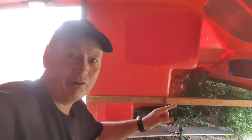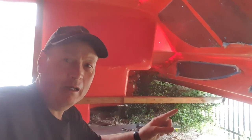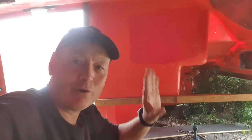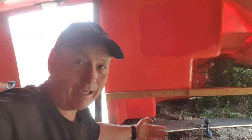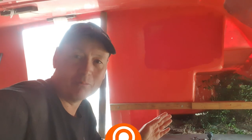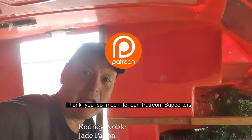So what I'm going to do is use this piece of 4x2 or 2x4 mounted here as a baseline, derive a template of the actual shape all the way down, transfer it onto some MDF, and then take it inside the hull and stand it up so that I know where all of these parts are going to fit. This is becoming an increasing problem — trying to determine those dimensions and just get a better feel for where I stand.